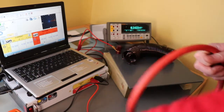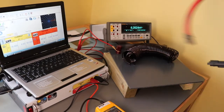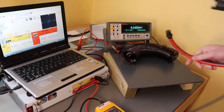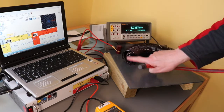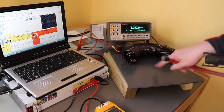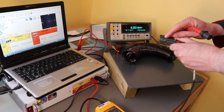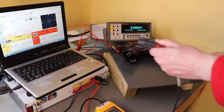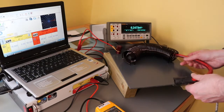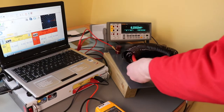So I have here my iFlex. It will go through so the coil is connected up here to the inside coil, so the current loops around in that direction. With the arrow on the Rogowski coil there, feed it all through that way so everything is in the same direction.